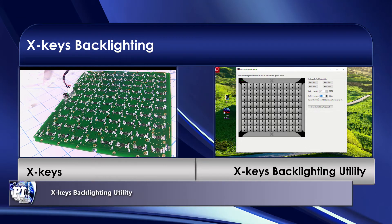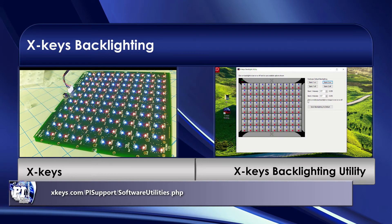If you get an XK80 off the shelf without modifications and plug it in, it would come on with both red and blue backlights on at 50% intensity. If you look over here in our backlighting utility — we have a link in the comments — the intensity on each bank: bank one is blue, bank two is red. You can have fun playing around with these in the utility, turn both banks off, or turn individual LEDs on. Backlighting for XKeys was really designed to be a general glow, but in vMix we can use it for key indication.